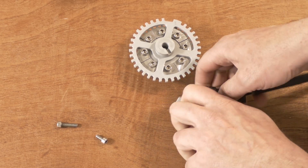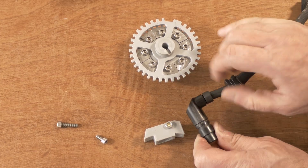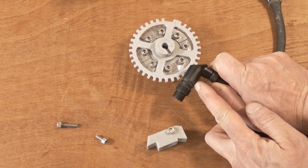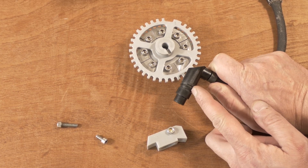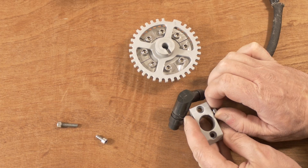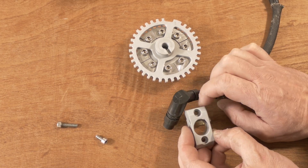We're gripping on the outside of the housing. I've removed the writing that was on there just to make it round and it should hold it quite well. The other groove is for an o-ring, so there will be an o-ring on there that'll seal inside here, and then this will hopefully fit in the modifications and be fixed in place with some epoxy as well as some screws.